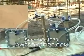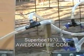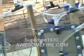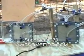I've done some initial tests on individual cells — cells one and two, and three and four — with both cells combined, and it's coming up to about 3.5 mmW so far. About a liter a minute with like five or six amps, twelve and a half volts approximately. I'll post this data later.